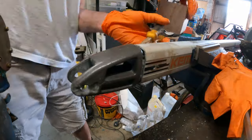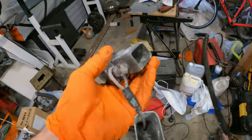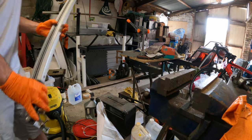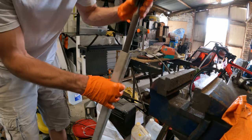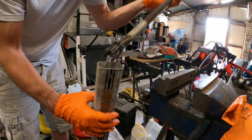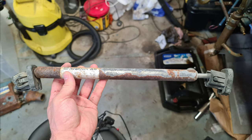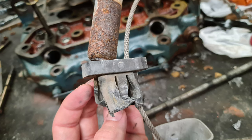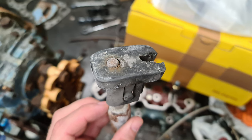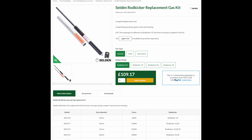At this point I still had no idea why it was jammed, or whether it had the gas strut inside it or whether it was just literally a solid Vang that was hollow in the middle. This is the moment when I discover it does have the gas strut. That gas strut has basically rusted solid, so the internal piston no longer moves. When that jammed, the plastic end fittings had obviously deformed under the load of being crushed without any give in the cylinder, and they had completely jammed solid inside the Vang. Luckily, all of those are service items and are sold by Selden in kits, so you can replace the whole lot. It's worth noting they'll sell you different spring strengths depending on the weight and size of your boom.